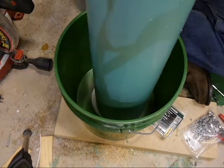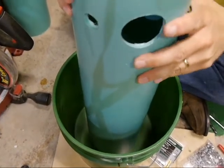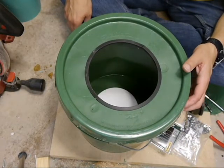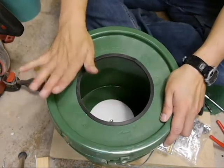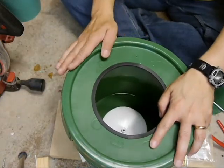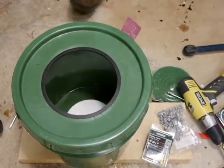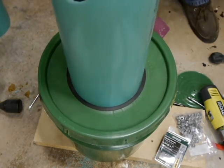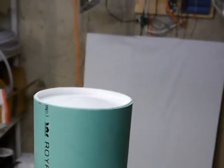The bottom of the pipe sitting on the mailing tube end fastened to the bottom of the bucket stabilizes it so that it doesn't shake around. A hole in the lid allows the column to go through the top of the bucket and seat on the mailing tube end. The lid may take a little persuasion to mount onto the bucket, but once you're done you can slide in the column and check the fit. We've still got a little bit more work to do on the top of the lid, but just to give you an idea of what the system's going to look like, we're going to put it together and slide the column in. Spraying a little water on the pipe or wetting down the inside of the grommet will make the pipe slide in more easily.